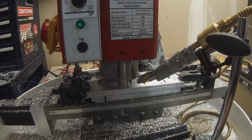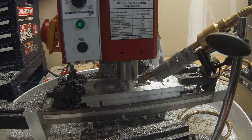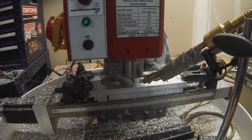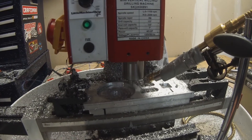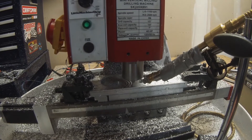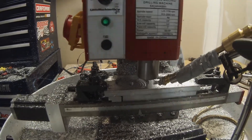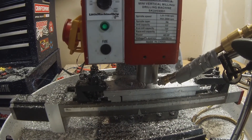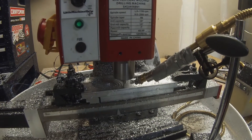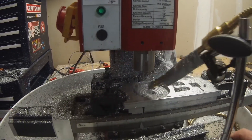This part I could probably save some time on, but I just needed to get that little curve on each side. The way I drew it, it goes all the way across for each depth — that's four passes to get down to a quarter inch, doing a sixteenth-inch depth per pass. I could probably limit it to just the portion where it's actually doing work and save a couple minutes, but it worked.